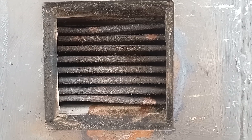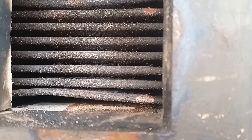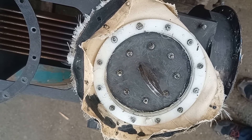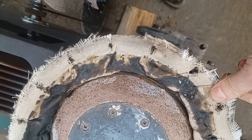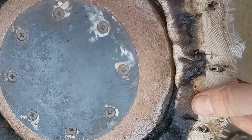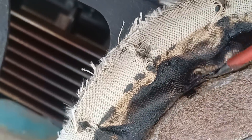After the high-power run with maximum heat there's been some buckling in the hot heat exchanger. We've just taken the hot piston back off to see how things are doing. On the inside we've got the glass cloth — it's lasted fairly well but in places it's actually worn through, which might be caused by the flexing.